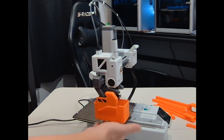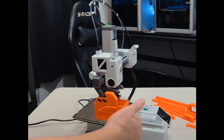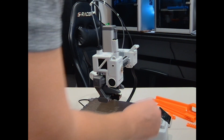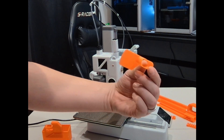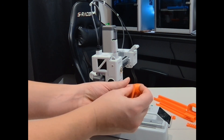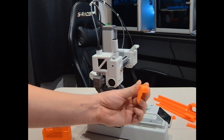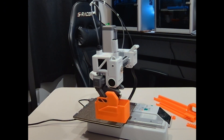That slides on and slides off. I've done some test prints with this — it doesn't fling off, it doesn't fall off. The biggest thing I would say is that when the machine's vibrating, you will hear the filament in here vibrating. The other option, if you do have an AMS, is to print off a bucket you can put underneath here, or print off one of these little fins. They're angled at 45 degrees so the filament when it shoots off will be deflected down instead of bouncing back onto the plate. I'll go ahead and put this one back on — and there's the first upgrade.